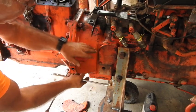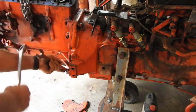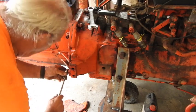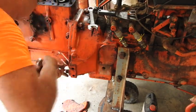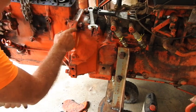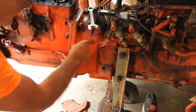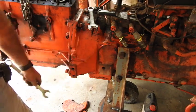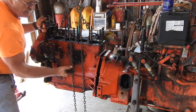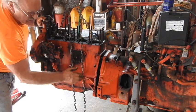This particular engine is only held to the torque tube by four bolts, so get your wrenches on there ready and give it a tug to get those cracked loose. I'm going to need a second for backup in there — that's starting to spin. I'll undo the other one on this side on the bottom, because the weight is going to have a tendency to pull it downward when I undo this, and then I want to get the chain fall hooked up to take the pressure off so we don't put any pressure on the spline shaft coming right off the crankshaft and into the input shaft of the transmission. You can see I've got this one broke loose right now — it just took a little bit of finagling to get it loose.